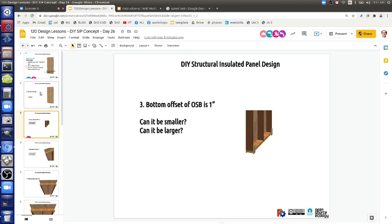With 1.25, you're also getting into some issues like getting pretty close. Like if you have a foundation pad like we have right now, which I don't think would be like that in real life, because everywhere you want to have a pad that goes straight down from your wall. You don't have a ledge where water could collect. But in this case, we do. So if you get close to 1.25, with all the irregularities, you might get places where the 1.25 inches ends up hitting the floor, and therefore you might mess things up. So 1 is very safe.